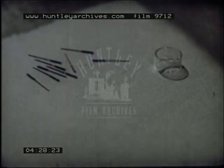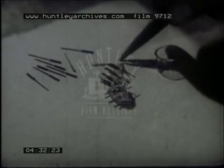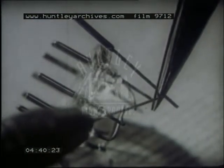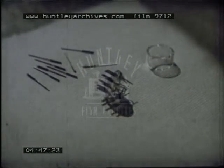The glass base is made up from a short length of glass tubing and these connecting wires. The connecting wires are made in three parts: the valve pin, the connecting wire, and between them a short length of metal which has the same overall coefficient of expansion as the glass, and which therefore makes a good airtight seal where the wires pass through the glass.